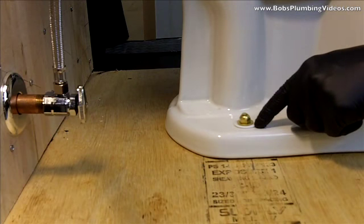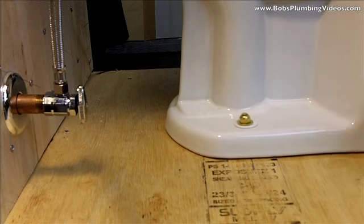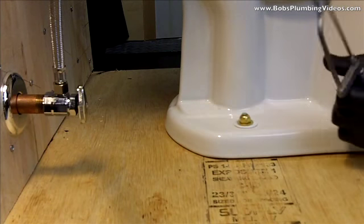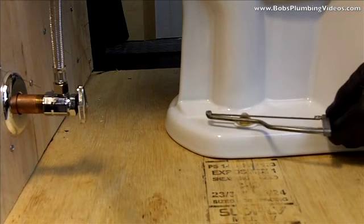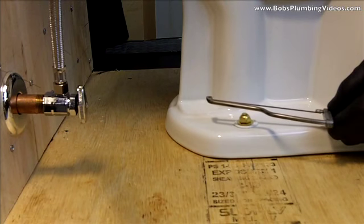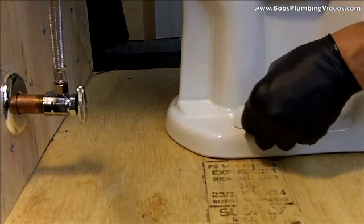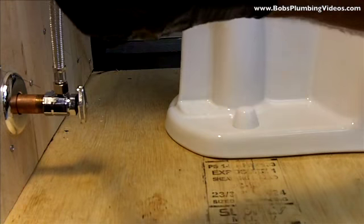You're going to repeat the procedure for the other side — put your little retaining flange down, your brass washer, your nut. At this stage you're going to come in with your mini hacksaw and cut the bolt. I cut it just above the top of the nut — I actually don't cut it flush, I cut it just above and leave maybe two threads for comfort. At that stage you can take your cap and snap it back on.